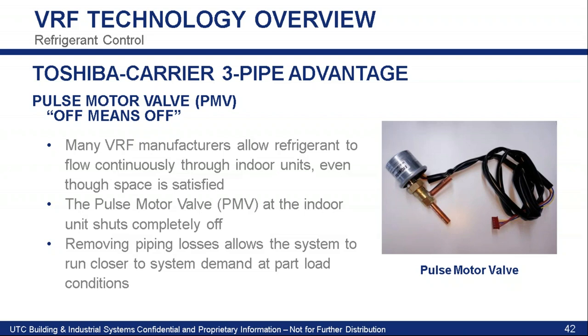In a commercial space, you often have to run the fan to ventilate when bringing outside air through that unit. Because we can close off the refrigerant completely, we're not going to have any hot or cold blow into the space — so you're not getting hot air blown on you just because other areas of the VRF system are in heating. On VRF systems, unless the thermostat is off, that fan runs everywhere when occupied. We get calls from other systems and manufacturers about it blowing cold when not calling for cold air — that's because they don't have 100% shut off. These units from the factory come with the EXV fully open, which is important for nitrogen brazing and pressurization during installation.